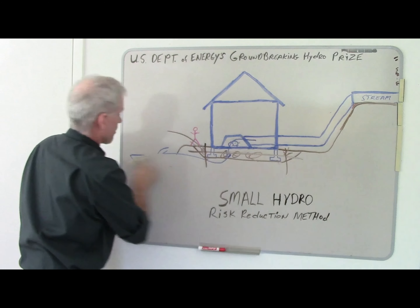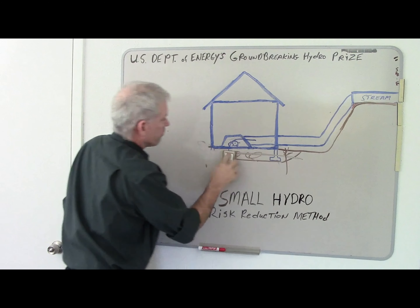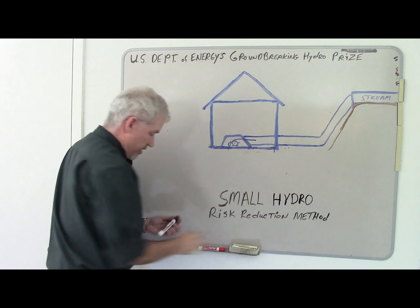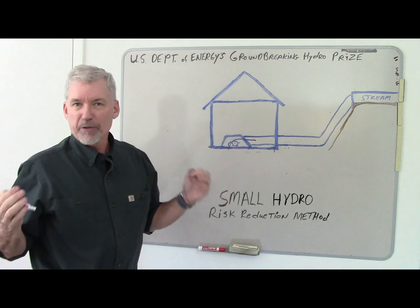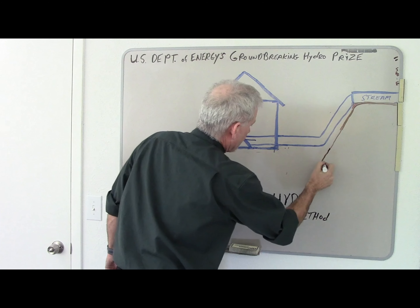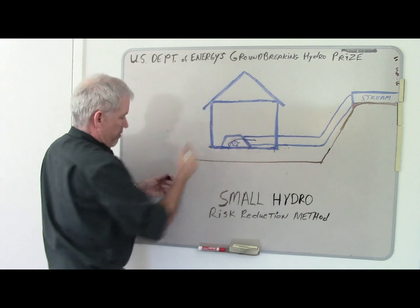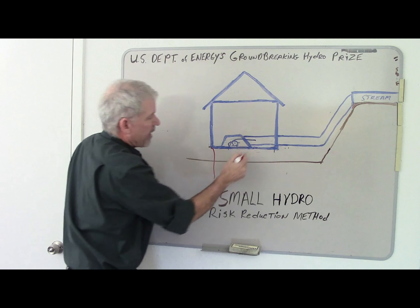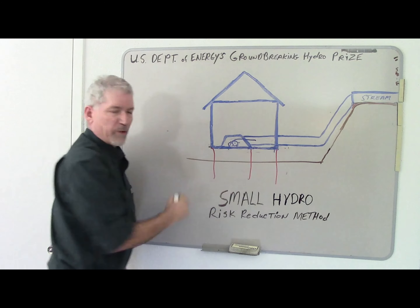Lots of possible risk. So we propose to raise these small power plants up a few feet. Yes, you lose a couple of feet of head, but in cases like permafrost you have no choice — you cannot dig down into the permafrost. The ground level is down here; we've raised this up on piers. These could be micropiles, they could be caissons — it'll just depend on what the soil conditions are.